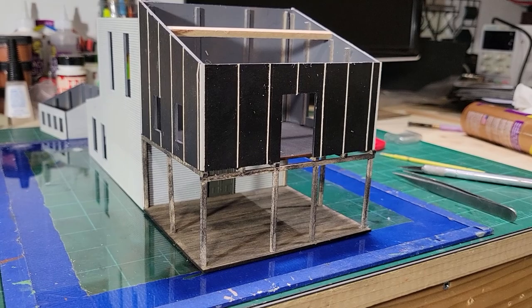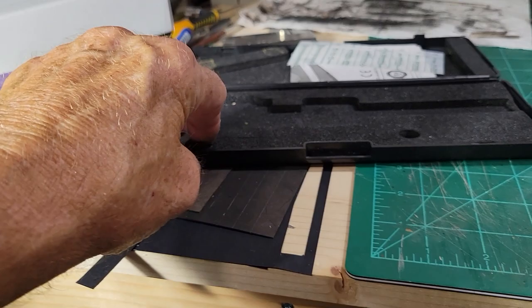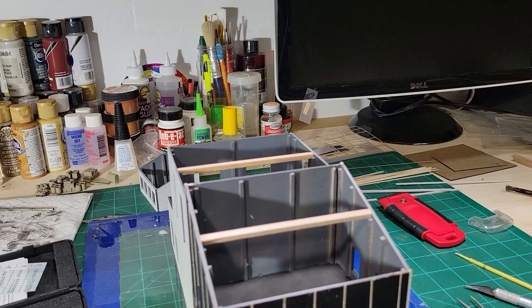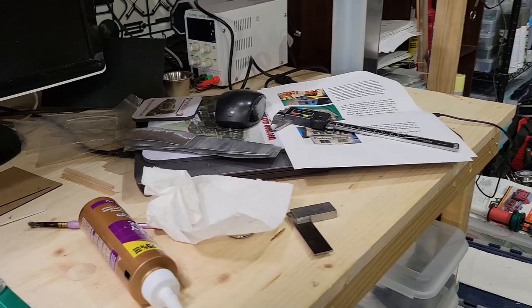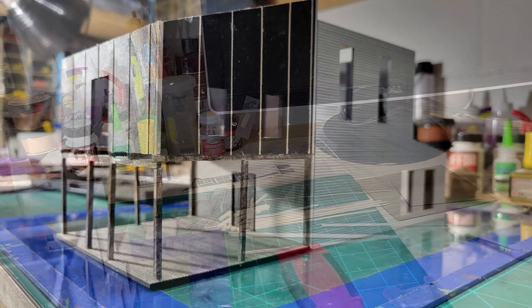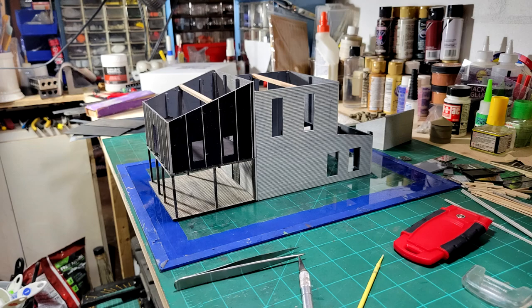And so just the windows, the roofs, I got the roof sections ready to go. I got two ones to get the tar paper on it. I got the line scribed on there for the tar paper. The other two roofs, this short roof here and this roof right here, is going to be the corrugated metal, so I have to prime that yet and get it the right color. Here are some more photos of what is completed so far.